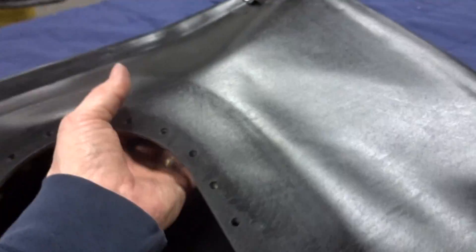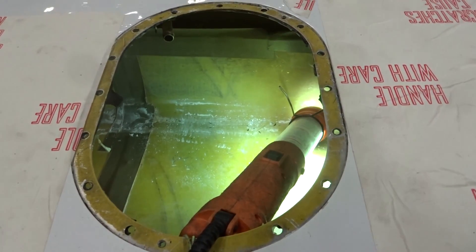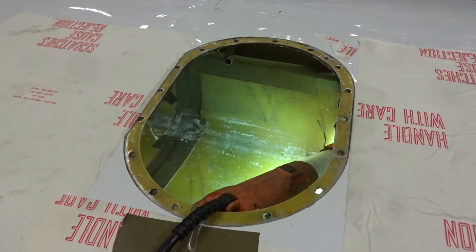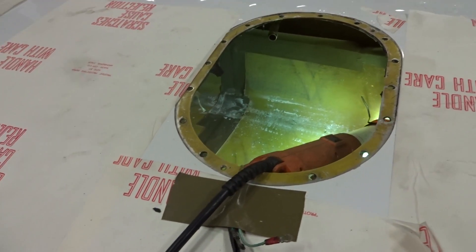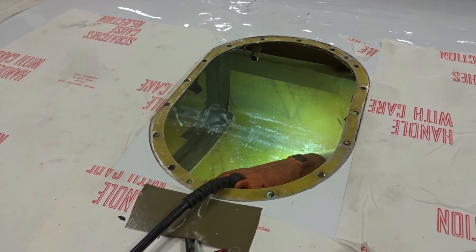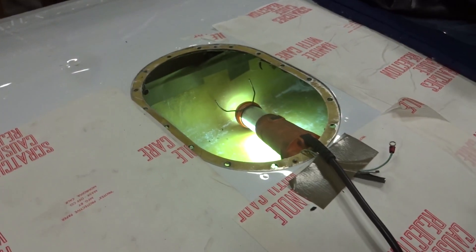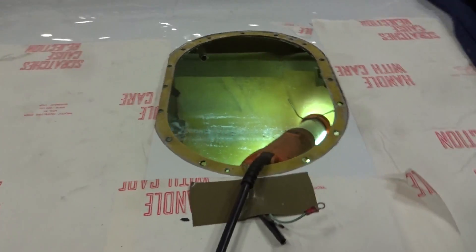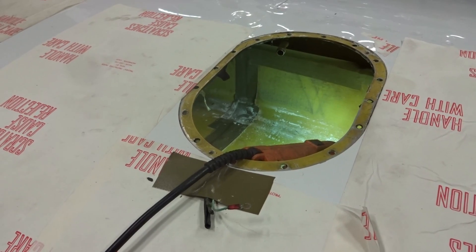This new cell is nice and flexible, and will actually fold up enough to get it in through this hole, which is the only way to put the fuel cell in. We've found a lot of airplanes — Pipers and Bonanzas — still flying around with original fuel cells. If they're not leaking, they're probably still okay. But you need to watch for the signs and symptoms: staining, smells — fuel smell in the cockpit is a big one. Many of these have been in airplanes for 40, 50, 60 years, and if you get to the point where they're leaking and causing issues, it's time to change them. They've lasted a lot longer than a lot of people thought they would.